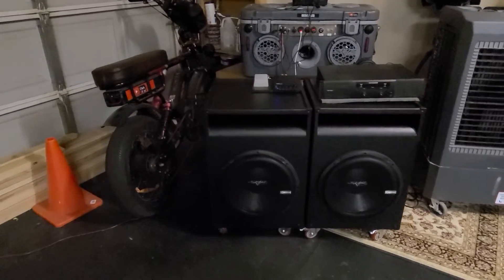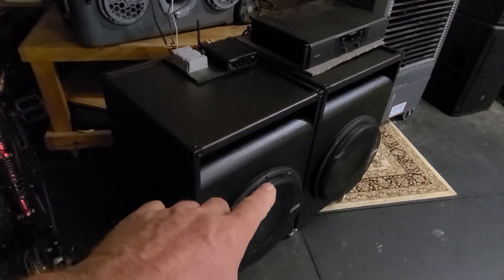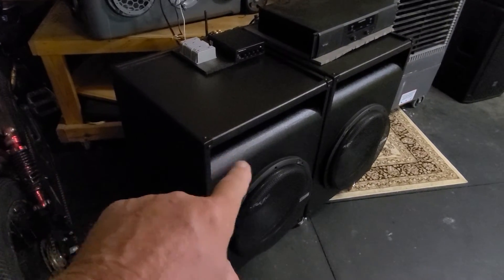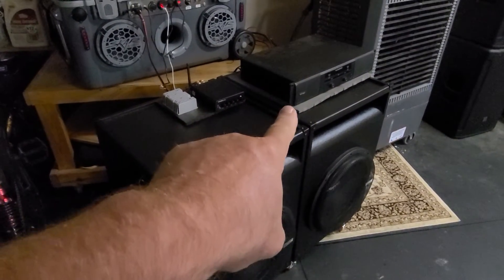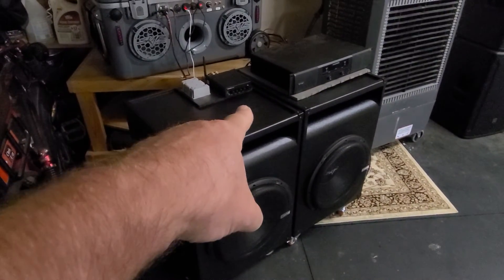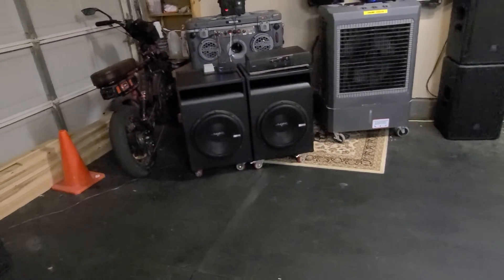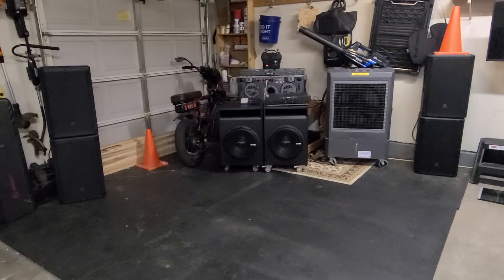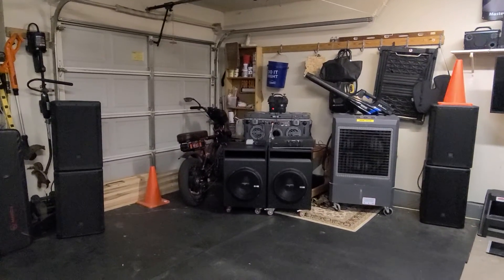Here's the kicker — I've got two more Seismic Audio cabinets in the house that I can convert over to these Skar Audio boxes and have four of them running as a 4-ohm load, two and two, to get 3000 watts going into them. Right now with just two it's already a pretty damn good marriage with 160 watts per channel on the mains. Can't imagine four — it'd just be insanity. Every note just growls and shakes the whole garage violently.